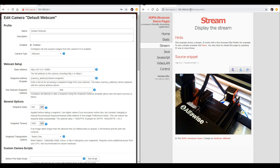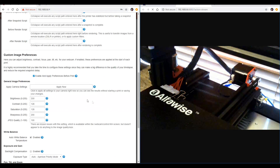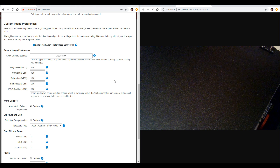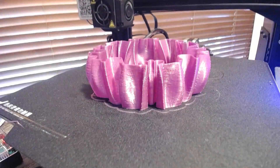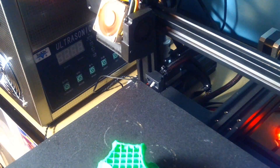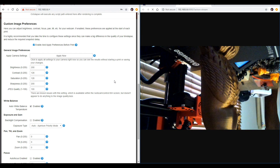I've moved my tab with the 8080 port side-by-side with the Octalapse camera settings, and this is absolutely essential — I can see these side-by-side in real-time as I'm configuring the webcam for Octalapse. I'm going to right-click on the stream image and say open in a new tab, and when I switch to that it is actually a video, not a static image. We're going to scroll down to custom image preferences and tick the box at the top. Now any changes we make, every time we hit apply now, will be shown on the right-hand side. The first thing we need to do is set up a test object — move our bed into the position that Octalapse will be taken and find some sort of printed object to put in place, so we can focus and set up the lighting for the camera. Skipping this step means there's a fairly good chance your object will not be in the centre of your frame and will be cut off or obscured. I've got my test object in place — it's upside down, but that's irrelevant to our current settings, so we'll fix it later.